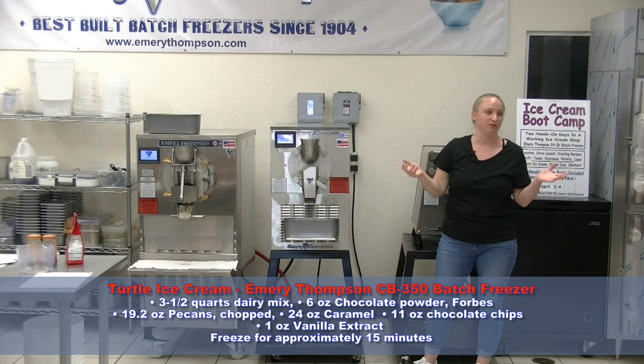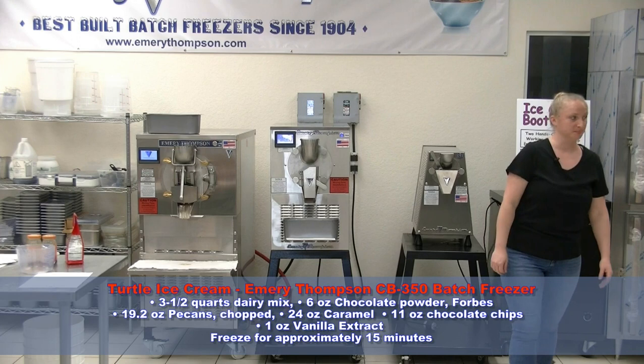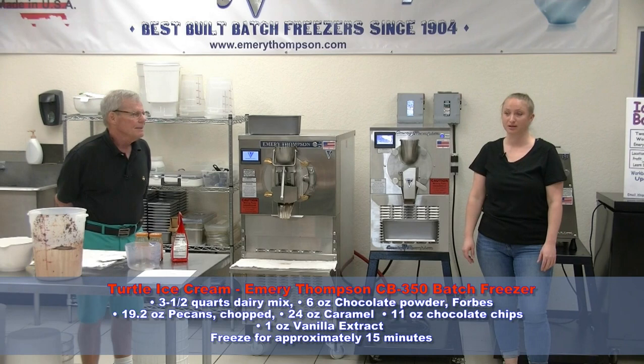Plus, living in Florida, we have thunderstorms all the time. You never know, it could be a thunderstorm coming through, could be a famous squirrel chewing on a line outside. You could have a brownout, a blackout. So at the end of the day, it's always good to just shut it off. Also, if you want to save a little money and not put in the wall mount, before you leave at night, just go to your breaker box and hit the breaker. That works as well. If there's no power to the machine, then nothing can happen to the machine. It's that simple.